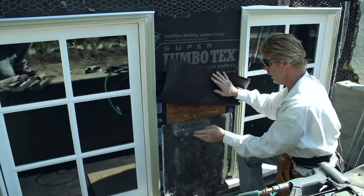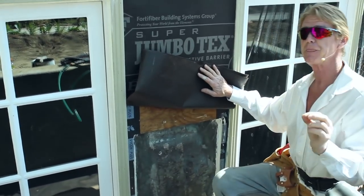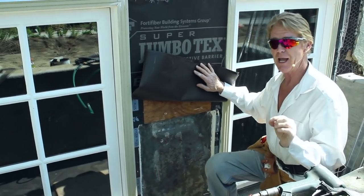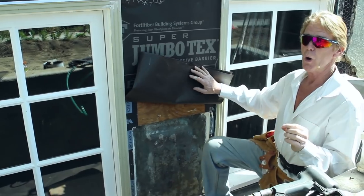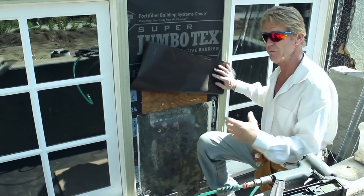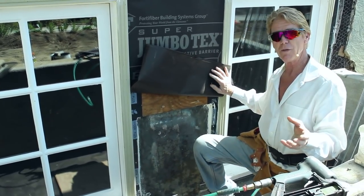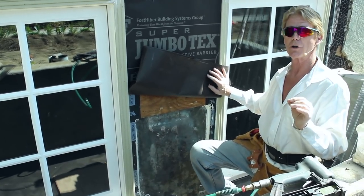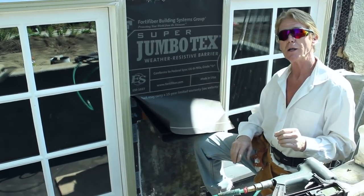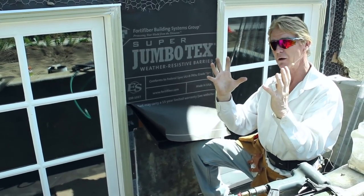If your concrete is not perfectly clean — if it is perfectly clean — you can just mist it, just sort of wet it. If it's dripping wet, you can't put the stucco on it because the stucco won't adhere. So what you do is you wet the concrete. For example, if I'm doing a whole house that's all concrete, I'm going to wet it the day before, and then wet it again in the morning, because we don't want it dripping — the stucco won't adhere. If it's too dry, we can't get a mechanical bond.